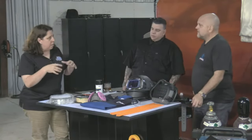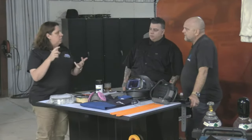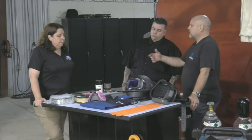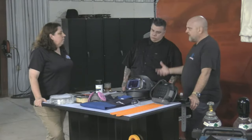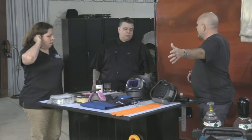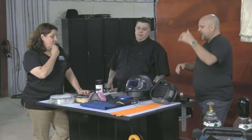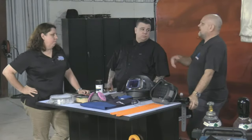Yeah. And you don't see that at all in body shops as you travel across the country, which is why shops are failing audits and cars are failing post-repair inspections. It's all about preparation. We've been talking about preparation a lot this week. Like Mark yesterday with the structural straightening, talking about his technicians sitting there, taking it all in, analyzing, and building that repair plan. I'm not just going to access the OEM procedures to get the cut line location, or to figure out if I have to pre-scan or post-scan. What I need to know is everything that's in there, read through line by line by line. We had a tech inquiry earlier today.